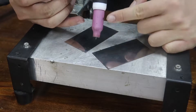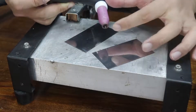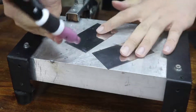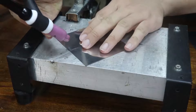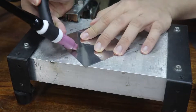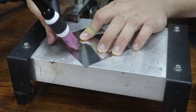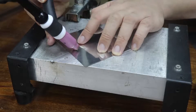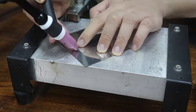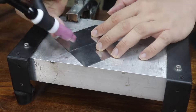I suggest using a smaller nozzle, like number four or number five, and the tungsten should be sharp but not too sharp. The most important thing is to keep a very small distance between your tungsten tip and the base material. You can use your nozzle to touch the base material, lift your tungsten tip slightly, and then practice moving the tip while maintaining the same distance from the base material at all times.